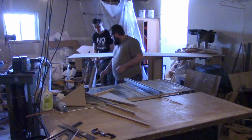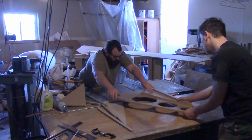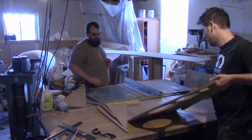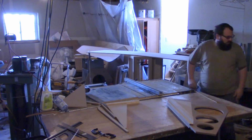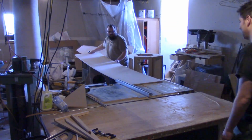But they each have to have an angle cut in each of them, a chamfer, in order to actually have everything sit flush. When you're working with triangles and angles and all that kind of thing, you really, really have to make sure everything matches, everything makes it flush and flat as much as possible.